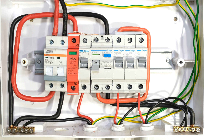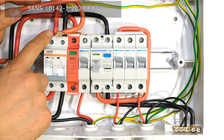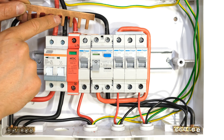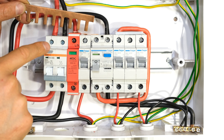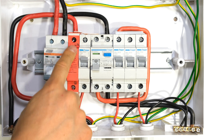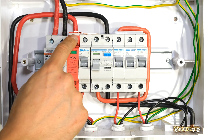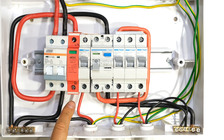It's very important that when you connect the surge arrestor you use a 16 millimeter cable, because that is what the SANS standard specifies. That also means that if you are using a bus bar, the bus bar must be able to handle at least 63 amps. This surge arrestor in a single phase circuit is just going to be between live and earth.